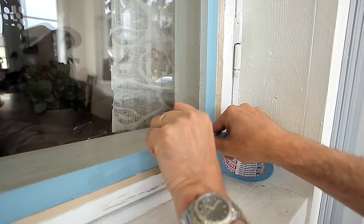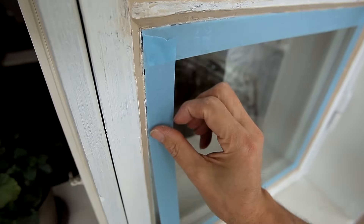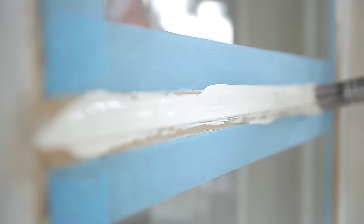Make sure to fill in any small cracks in the wood. Use the blue masking tape — it is designed for outdoor use. Place it approximately one millimeter from the putty edge. If you follow the instructions carefully, you will avoid getting any paint on the glass.